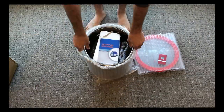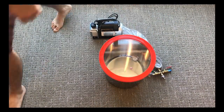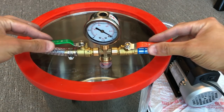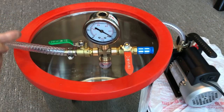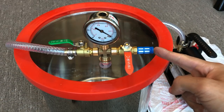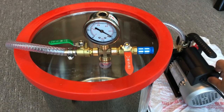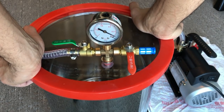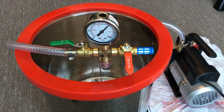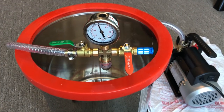Once it arrived it was super intuitive to assemble and set up. For those who don't know, when a valve handle is in line with the hose it means that it's in the open position. This one connects to the vacuum pump and this one allows us to release the vacuum. So let's close that and conduct a quick test. You might need to press down the lid at the start in order to close any gaps between the lid and the actual chamber. The pull of the vacuum will then keep it shut on its own and the pressure will drop inside as you can see by the dial.